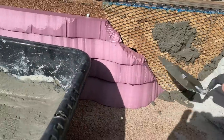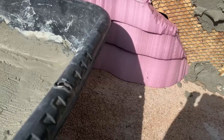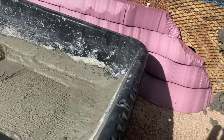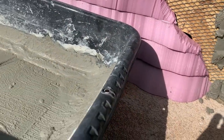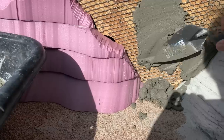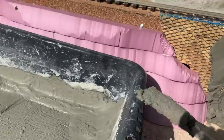Now onto the huge wall, the China wall, and that has to be built in place. Oh my. And that adds, let's call it complexity. I can see that. So I have to kind of take the mortar mix and throw that into place and try to embed it down into the wire and then really press it down into the wire. Otherwise, it just wants to fall completely off of there.